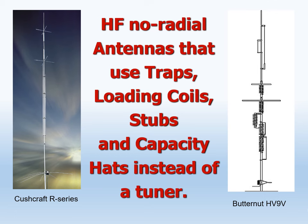Now consider the two commercially available no-radial HF verticals. How do they get away without a tuner? Simple — the coils, stubs, traps, and capacity hats are the tuner. But when I was building my prototype no-radial flagpole antenna, I saw that these antennas could not be used as a flagpole antenna — the neighbors would easily notice the extra hardware and immediately know it isn't just a flagpole. What's important here is that the added hardware performs the same function as the base tuner for the flagpole. Either one — coils and traps, or a remote automatic antenna tuner — is necessary. A non-resonant antenna must be tuned and matched.